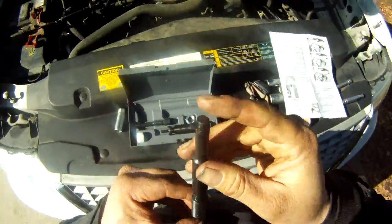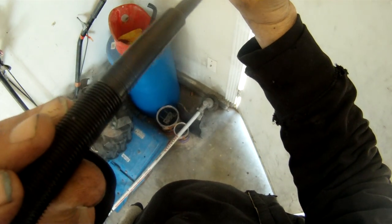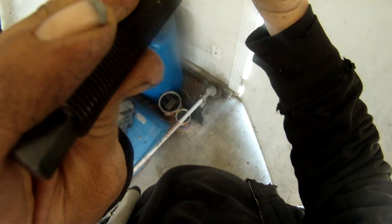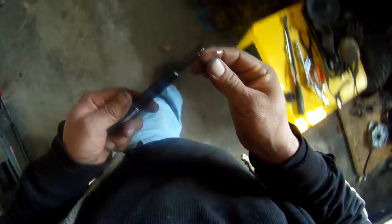This is basically a tapping screw. Any time I tap something I lubricate it — even if it's just a hair. So I'm going to put just a dash of oil on that. Just a dash of oil. I didn't even wipe it off but now it's a little oily. Don't want a bunch of excess, just a little lube. Now we're going to get it installed.